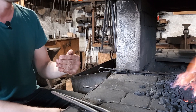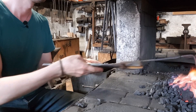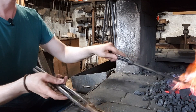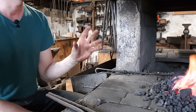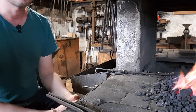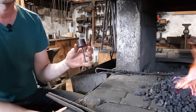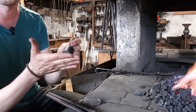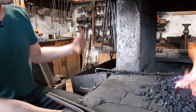By doing that, I removed the stress I had caused. So what I'm doing now is heating this up because I want to harden it. I do that by heating it up to about 800–850 degrees Celsius and then cooling it down rapidly. One way of telling when you've reached that temperature is checking with a magnet — if the magnet is no longer attracted to the material, we have reached that point and we're able to cool it down and it will become hard.